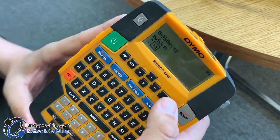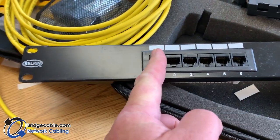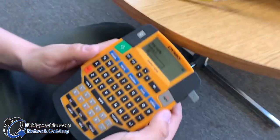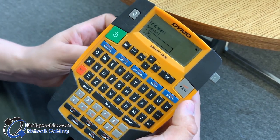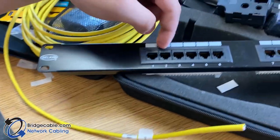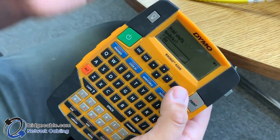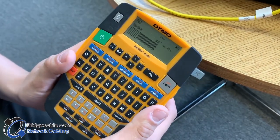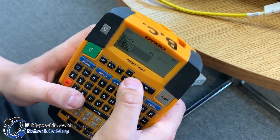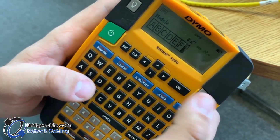All of the following prompts are standard, just hit OK through them — this sets the spacing for a patch panel. A lot of times out in the field you'll see the wrong spacing from hacks. This is asking if you want to print empty modules: if we're only using four ports, it still asks whether to print five and six — hit OK for consistency. Then type A in the first module, press the right arrow key to go to the next box, put in B, and continue until you reach the end.